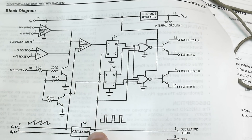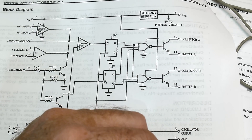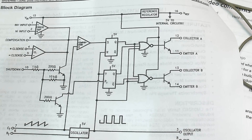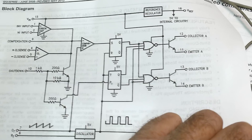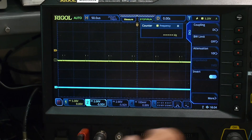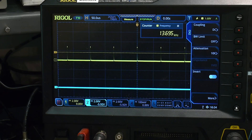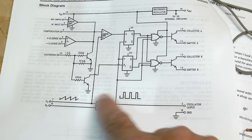The output of the oscillator comes out on pin 3. Let me grab an oscilloscope probe and look at pin 3. We need more voltage and let's find our trigger level. We're outputting little pulses at 13.7 kHz. Back to the data sheet - sure enough it says there should be pulses coming out, so the oscillator is running.